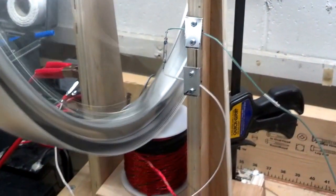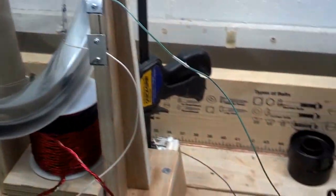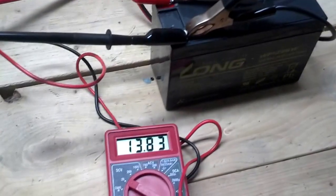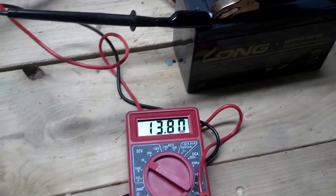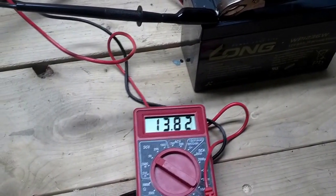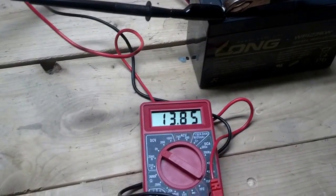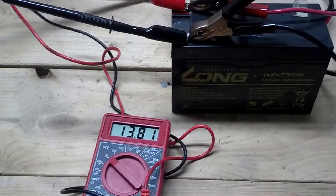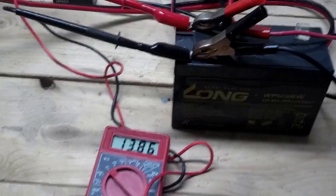Very simple — reed switch, SSR, capacitor, and that's it. It turns out it works pretty well. It's dumping a little bit more often than I'd want. I would use more capacitance with less frequent dumping. But for now, this seems to work. That's about it. Thanks.